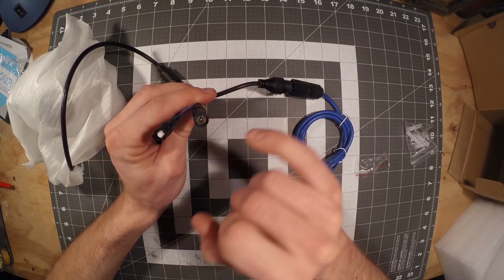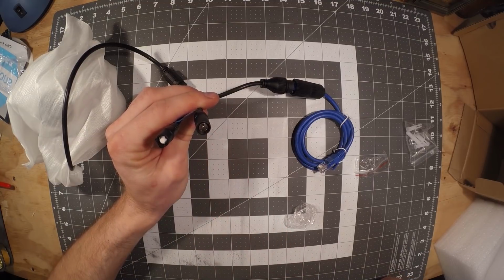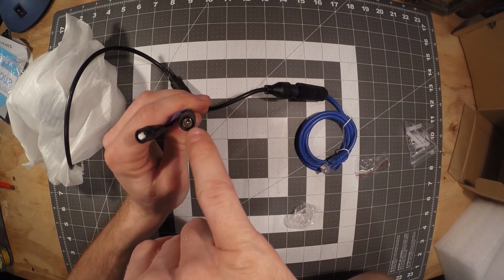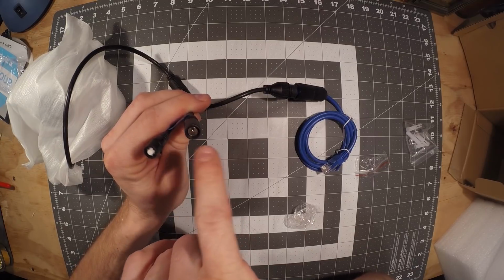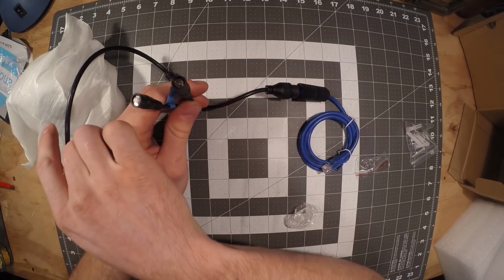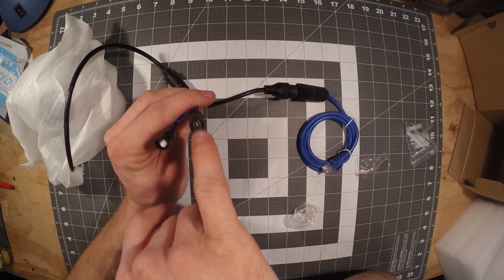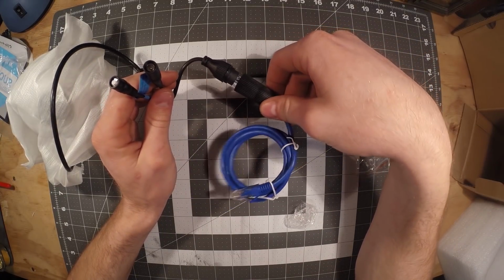That's important because if there's power here, this will start to corrode over time, especially if it gets wet. Okay, that's a big issue that can eventually cause intermittent problems. If this starts corroding and shorting out, it could actually make the camera itself turn on and off because it's shorting out. And it can also cause problems with your PoE switch.